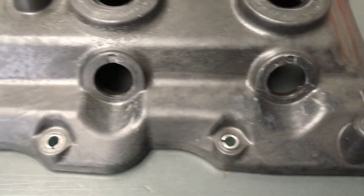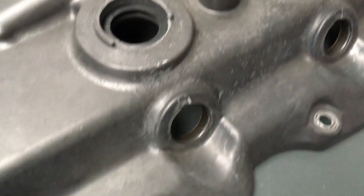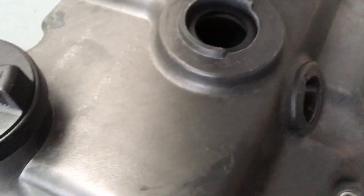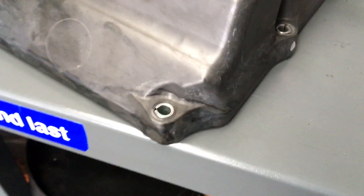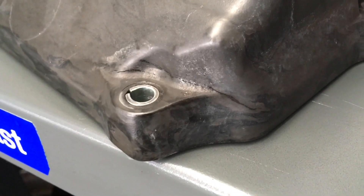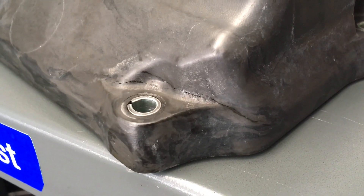What I'm trying to say is you need to clean it up properly so you can inspect it for cracks. Usually they appear at the front of the cover, at this corner, pretty well across here. This one is okay. The other place they crack is kind of across the back corner — basically the opposite way. You can see the oil stain, and the oil stain is your telltale sign of cracks before you even have to look harder.